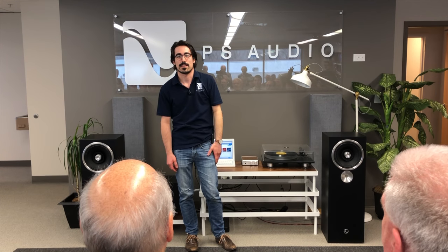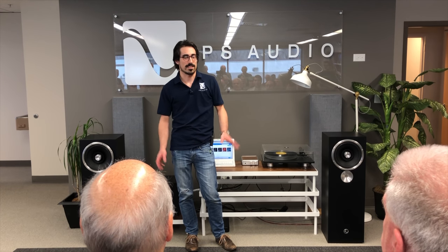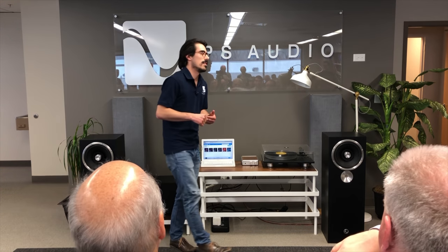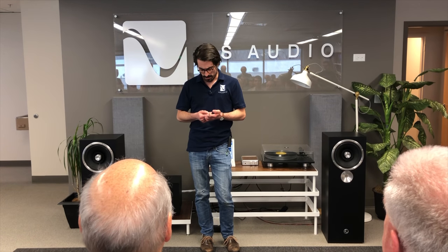It could be horrible. We've had bad first listens to products where we had to rethink it, or there's some key thing we're missing and need to go back, and many times we find what those things are. Well, I hooked this thing up, and right away I was pretty happy with it. I was like, okay, we're definitely on the right track. Right away, things are right. I put my ear up to the speaker and I can't hear noise at 66 dB of gain. That's good. Going in the right direction.